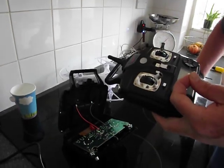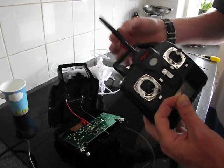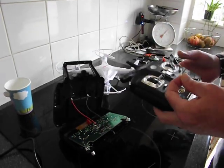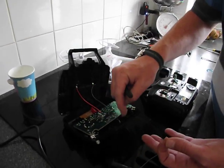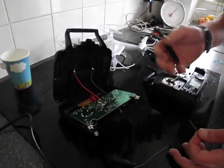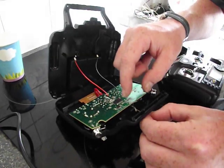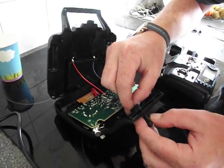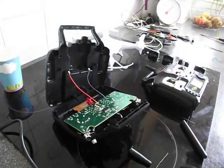Now if you want to, you can get yourself another 2.4 GHz extender antenna and increase it by adding something like that, which will fit in nicely into there and connect to the internal antenna. But I do strongly suggest you do this mod — basically the antenna that comes with it isn't very good. It's pushed down inside the plastic board, which is why it has such a limited range. You get another bit of wire just the same length as the antenna in there, double the size, which will then feed into this dummy antenna which becomes a proper antenna, and you'll notice the range increase. It's a very easy mod to do.